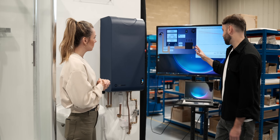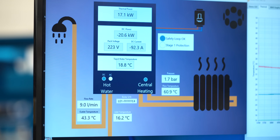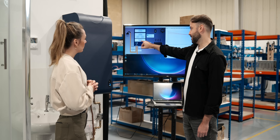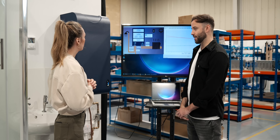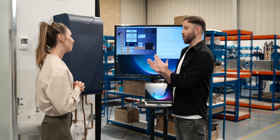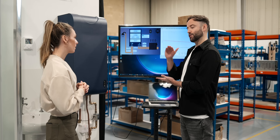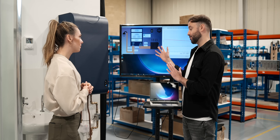Looking at the display, you can see what's going on in the boiler in real time. Cold water comes in — the inlet temperature at the moment is about 17°C — before it gets heated by the heating elements. We've got a thermal store in there, so that thermal energy is added to the water first, giving a small temperature increase to a tepid water temperature, before the elements finish heating it. Power-wise we're currently doing about 23 kilowatts out of the 30 available — because the higher the inlet temperature, the less hard it has to work.